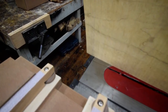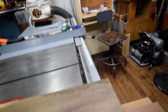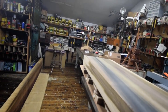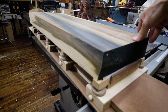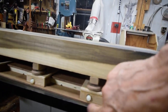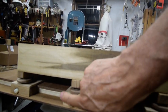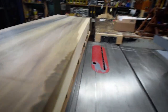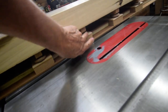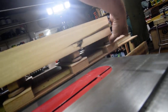Here's how this works: load your board. There's a small stop on each end. And if you see, this is still rocking. You bring these supports up until they just touch. Do the other side.